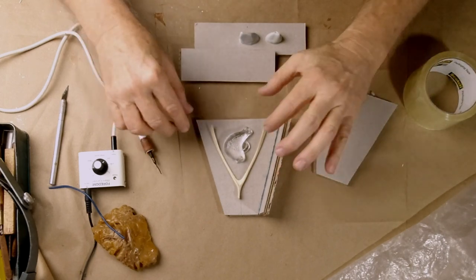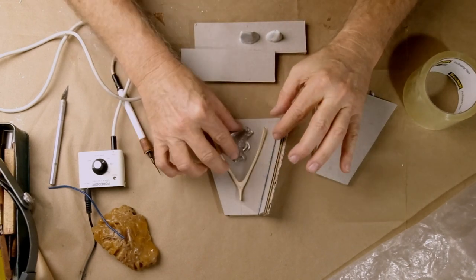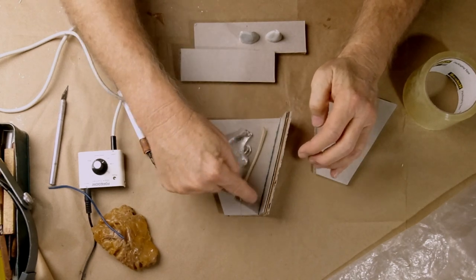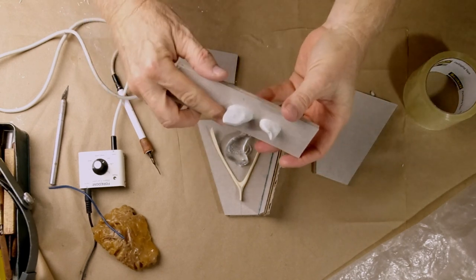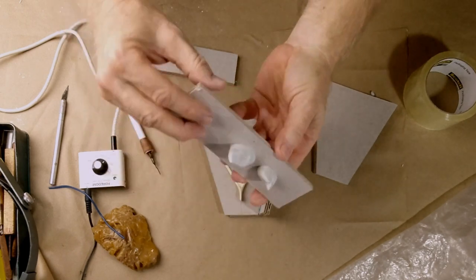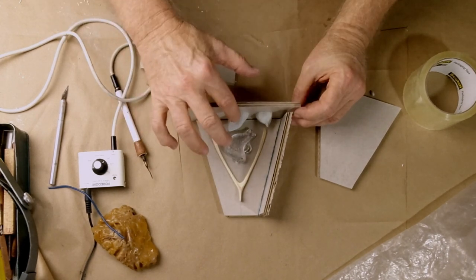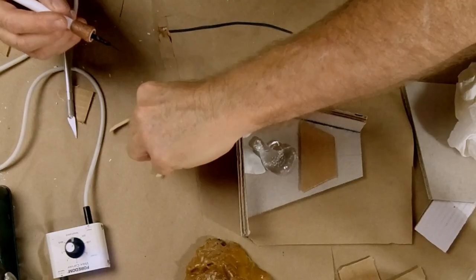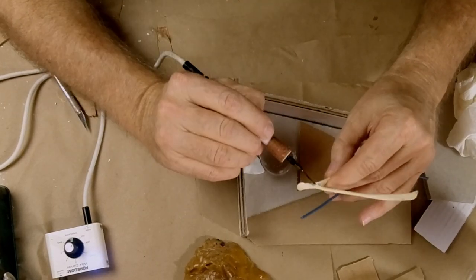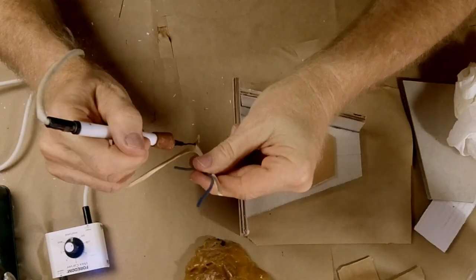The easy way to tape the box is to put packing tape over a big sheet of cardboard and then cut the parts out — don't put the tape on afterwards. I've already begun to glue it together, and I'm leaving a generous amount of rubber around the piece because that's going to be the cut plane. The sprues I made out of epoxy sculpt, shaped like funnels designed to fit the pieces, which saves a lot of cleanup time later.